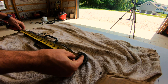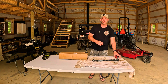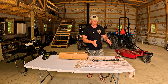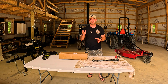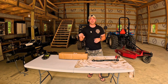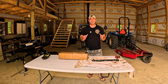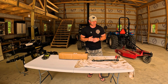On mine, all the way retracted it's about 17 and an eighth inches. When you look up your hydraulic top link, take that measurement and look at the description — you want to get as close as you can to your original size. The one I ordered is 18 and an eighth, so we're super close, within an inch. I'll put a link in the description. They have several different sizes depending on the size of your tractor.